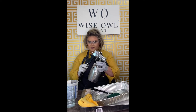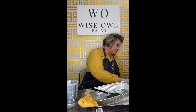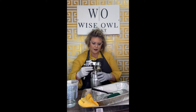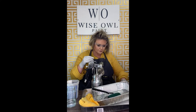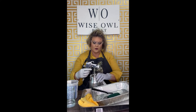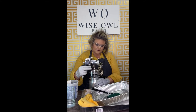Remember, take it off. Release the pressure. Do not ever point it toward your face. The reason why I have you spray it through, especially if it's 1 hour enamel or a primer, is because it will get through at a higher pressure around your needle and your spray nozzle and in the hose, holes in your spray cap.